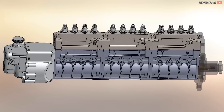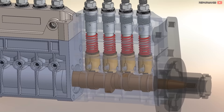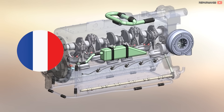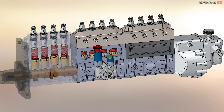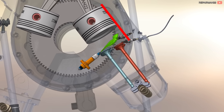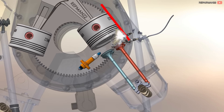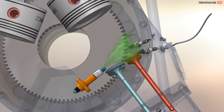Although diesel injection already existed, gasoline is much more aggressive and attacks the seals and O-rings of the pump. It's also not a lubricant like diesel, which causes the pump pistons to wear out quickly. Overcoming these challenges meant that Bosch's invention needed to be kept as a complete state secret — France, the Soviet Union and other countries wanted to buy the engine, but the government did not allow export to its future enemies. The pump consisted of 12 inline pistons that raised the fuel pressure to 90 bar and injected it directly into the combustion chamber. The spray injection method was difficult to solve, as a large amount of fuel hit the cylinder liner and washed out the oil; when the piston passed, it would rub and break. Later, the spray was made wider with a special nozzle, and partly because the engine was running inverted, the extra oil helped.